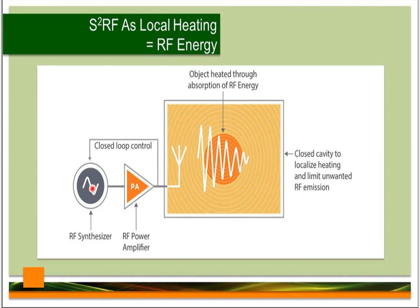That means that we have the most important thing that I will always say, if people ask me what solid-state RF energy is all about, I answer the most important thing is control. Because here with the synthesizer and phase control that you can build in, you have all the ingredients in your hand and control about power level, frequency within the band that you are allowed to use, phase settings, and you can be very fast in handling that kind of RF and change it.